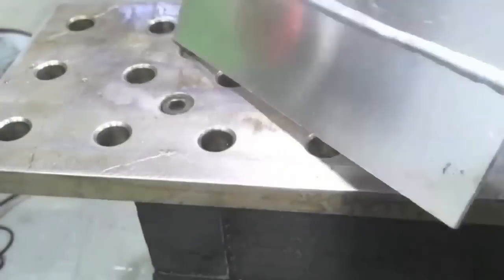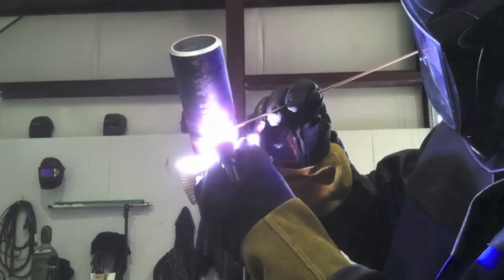What we're looking at here is some TIG welding aluminum eighth inch thick using a step and pause type technique. You can see I'm lengthening the arc as I add filler rod. Here I'm welding an open butt groove weld with a 37 and a half degree bevel, one eighth root opening on mild steel.